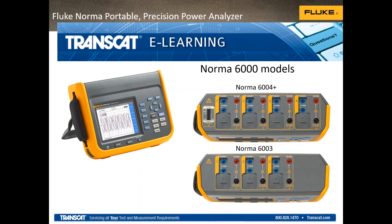The initial slide here gives us a couple different variants of the Norma. There's a four-channel and a three-channel version. The four-channel version, if you're doing neutral measurements and adding in a neutral — so you're not just doing delta configurations — you have the additional channel for a neutral. You can certainly do single-phase measurements as well as three-phase measurements with either tool. We also have a plus variant; the plus model allows you to incorporate a speed and torque sensor if you're doing motor testing.